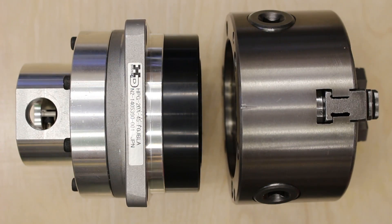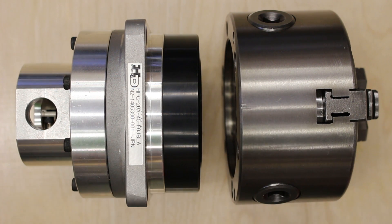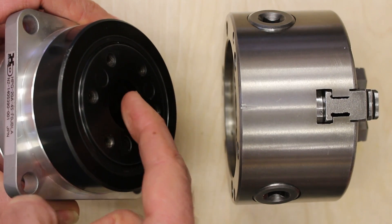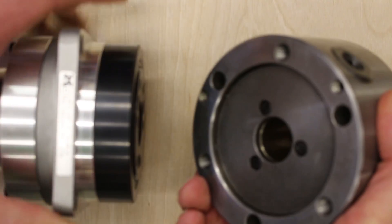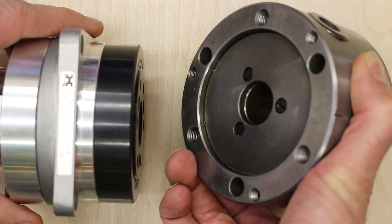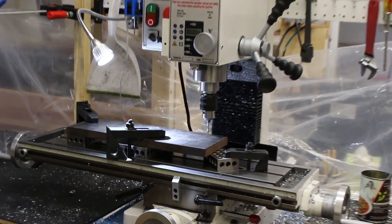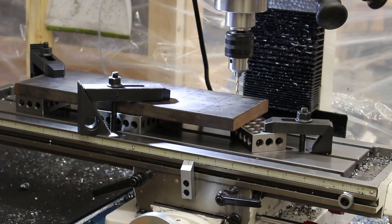The first part I'm going to make is the faceplate that goes between the output flange of the harmonic drive and the back of the three-jaw chuck. I need to make it fairly accurately with a stub that fits into the hole in the center of the output flange, holes drilled for the drive mounting bolts, holes for the chuck mounting bolts, and a boss that fits into the recess to locate the chuck on the central axis. I'll make it from a piece of 3/4-inch hot rolled steel and start by drilling all the holes on my milling machine, clamped so I can drill through without hitting the table or support blocks.